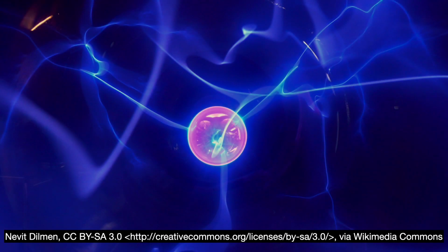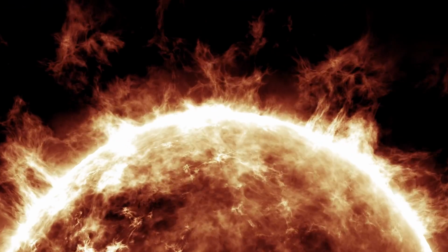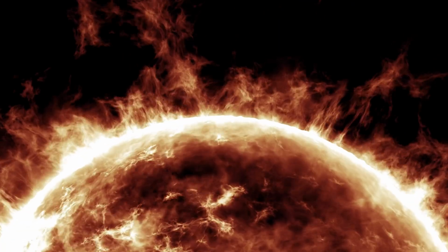Plasma is the fourth state of matter. The plasma we use for plasma etching are ionized. This means the gas atoms become charged by either losing or gaining an electron, creating ions. When a significant percentage of the gas atoms become ionized, then we have a plasma. The sun is made up of plasmas, and they do fusion research with plasmas heated up to incredibly high temperatures.